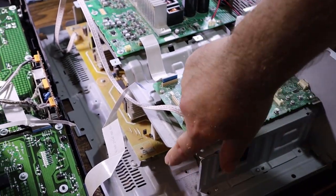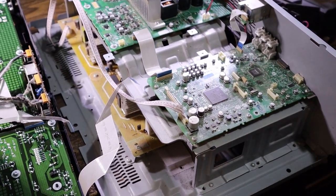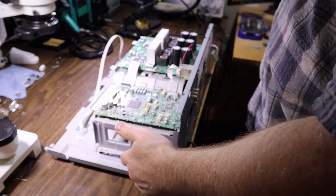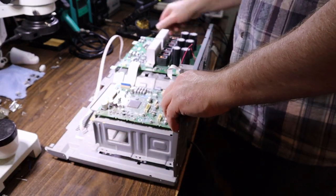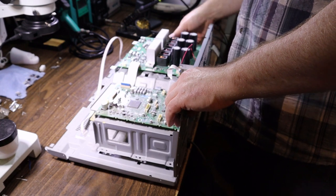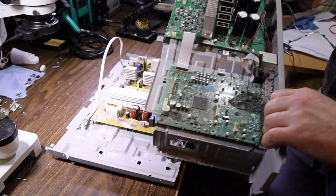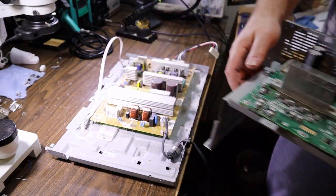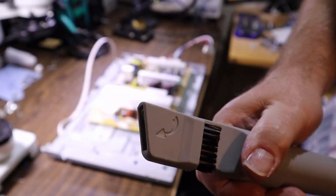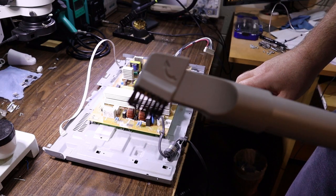This complete chassis plate runs right across over the power supply board. With screws down the sides and back panel undone, the whole thing lifts off as a unit. Unplug this flex and this multi-flex cable — that's the main power feed to the amp module. I love stuff that's modularized — makes it easier to work on. You'd need hearing protection when using this thing; it's incredibly loud, and when you flip this down it's like standing behind a jumbo jet.